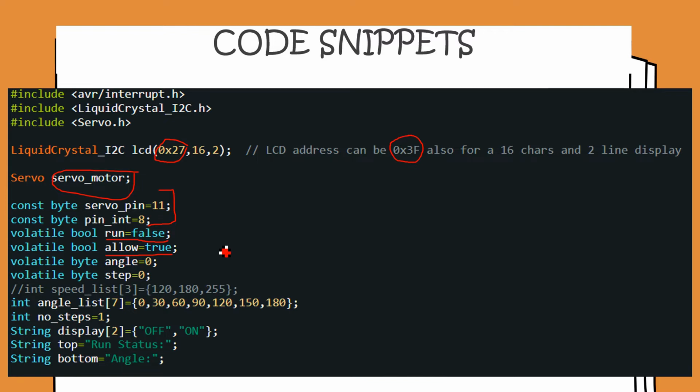A pin change interrupt is basically an interrupt which can track a transition, but it cannot distinguish between a high to low and a low to high transition, and using this variable enables us to make this distinction. For more details on this, there is a tutorial on the use of pin change interrupts, and the link to that is there in the description box as well as on the top right corner of the screen.